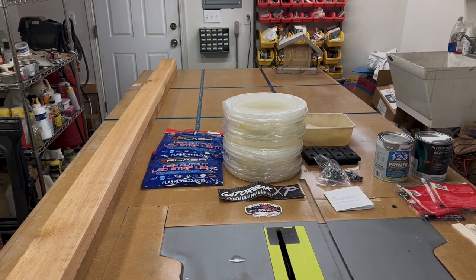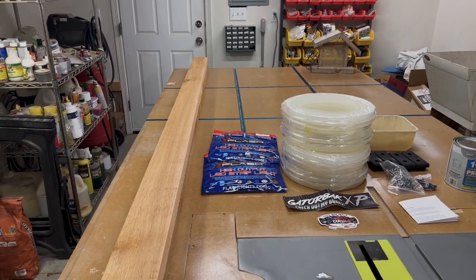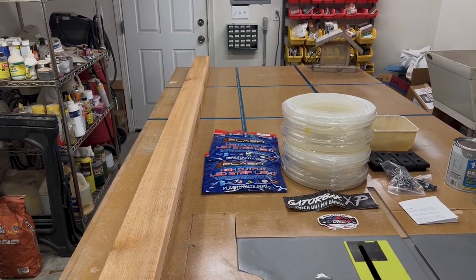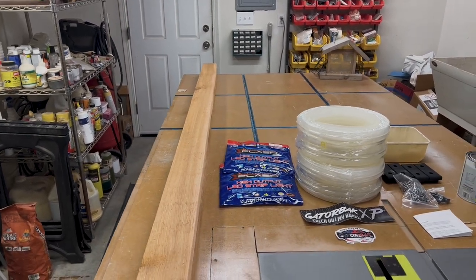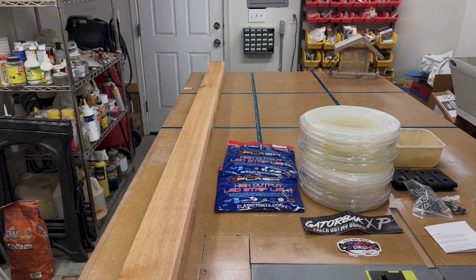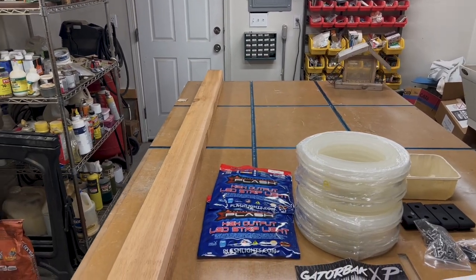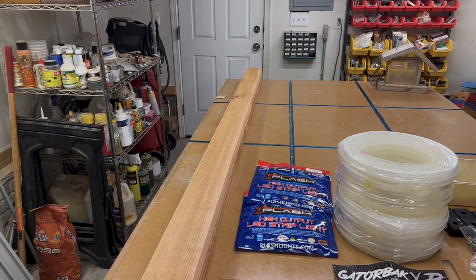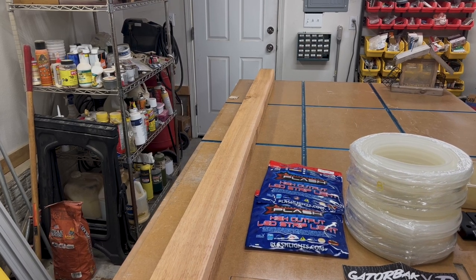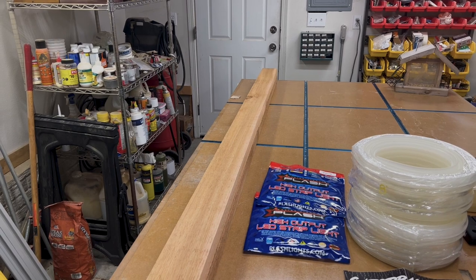Okay guys, so let's talk about materials for today's project. So this is the wood I'm using. These are 2x4s. I have a 16-foot boat, so it doesn't require big 2x6s. The wood choice I went with was rough sawn cedar. The reason is that in my area, most of the 2x4 cedars are treated. Don't get treated wood. The rough sawn stuff has a lot more waterproof characteristics without being treated. So it's safe for your boat, and it's safe if it comes in contact with the metal. It's safe for all the hardware that it comes in contact with.